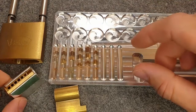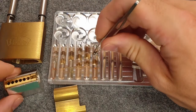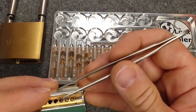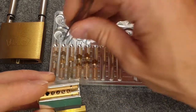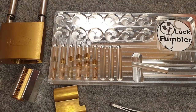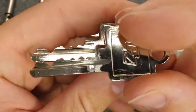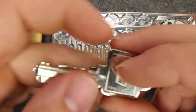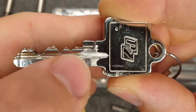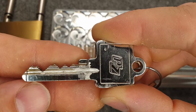I'm back from the workshop. As you can see I've laid out all six pins — I didn't check all of them yet, so let's populate them quickly. Here are the keys as they were with five pins, and here is the one with six pins now. If I lay them on top of each other, the bitting stays exactly the same and I just added a sixth cut here. For that I removed the shoulder back as Chris Capone suggested — great tip.